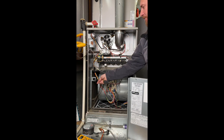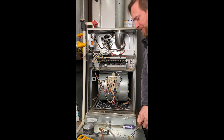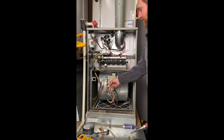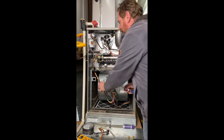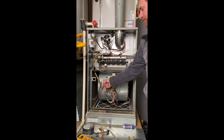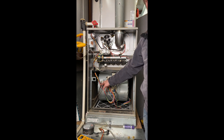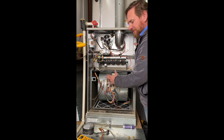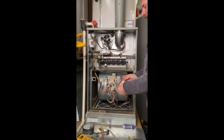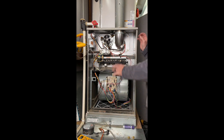When I've taken this door off, we have our door safety switch that opened, and notice that our LED light went away — that has shut off the power for the system. The next thing I want to do is take loose the R-wire. If I loosen the screw on the R-terminal, I can pull the R-wire off. The R-wire happens to be red, but just because it's red doesn't mean it's the R-wire. R from this control board connects to R at the thermostat. I'm taking this loose so I can have control of this IFC — when I get ready for a call for heat, I'll connect R to W.